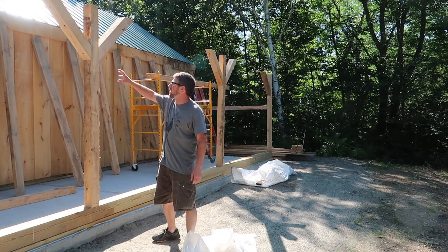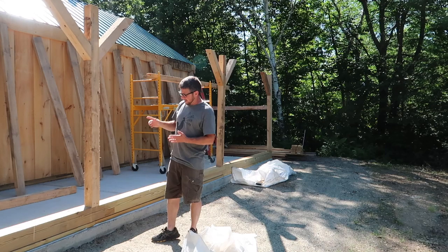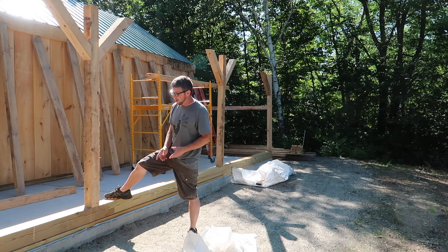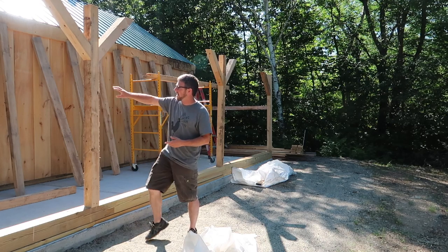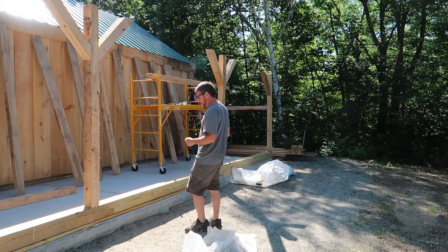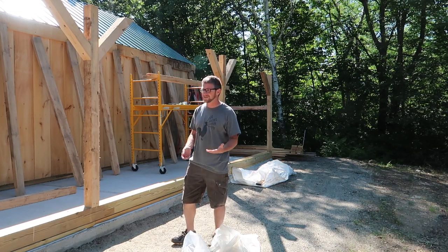So what we're gonna do is our posts only need to be 69 inches tall, and right now they're 77 inches tall. That includes from the floor, and where we put a pressure treated 2x6 sill plate in that's not called for, we can take out these 6x6 pressure treated sills, and then we can have our posts all the way to the ground. That way when we have barn stalls here, we can have the door and the animals don't have to walk over a 6x6.